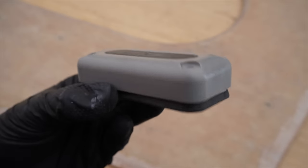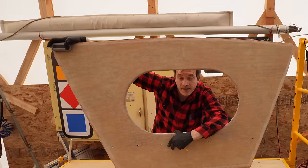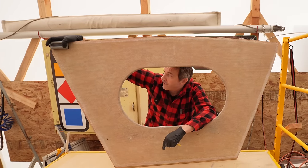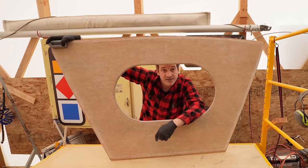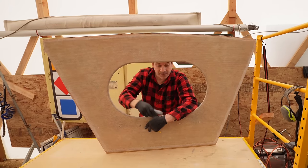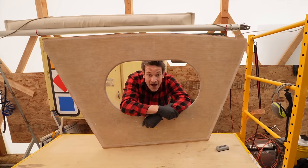I'm going with this multi-seal cable gland and we're going to put this up in the top corner. I'm going to prep these holes now while it's off the boat — it's going to be easy to drill them perpendicular out here. I'll get both surfaces done and then we'll treat with epoxy too so it's all sealed up just like everything else we're doing, so if we get any drips it's not going to get inside this bulkhead.